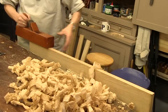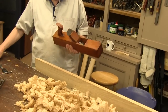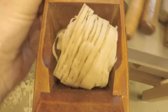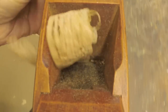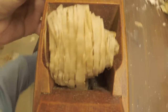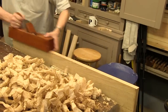So let's take a shaving or two with this wooden bench plane. It's working very nicely — it's almost too light on the surface of the wood. I'll make a minor adjustment and take a slightly thicker shaving. When I look inside the throat of the plane and see the shavings just curling up inside, I see how these planes were abandoned not because they didn't work well, but because they didn't keep pace with the industrial world. There's almost zero resistance — it just pulls itself to task and will shave all day long.